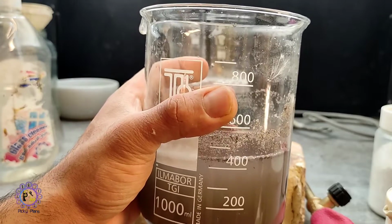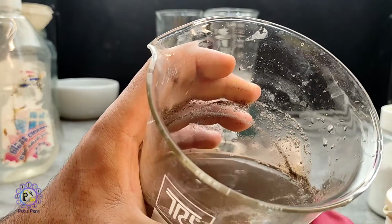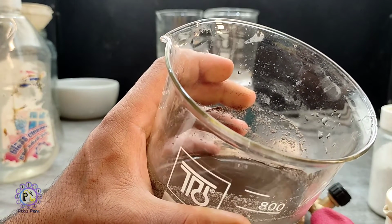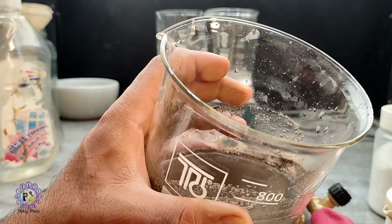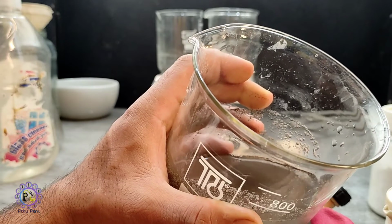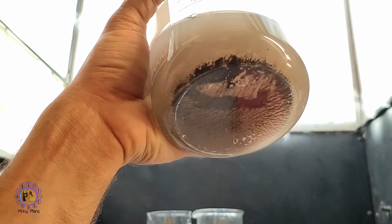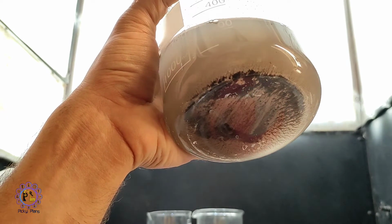This is the black residue that I collected from the nitrate solution and then separated using ammonia solution from the silver chloride, and I think it is tin metal hydroxide. I tried to reduce it to metallic form by reacting it in acidic condition with aluminum powder, but it seems to be unsuccessful. Actually, it isn't worth doing all this hard work to reduce and process this black residue, and I just did it for investigation, and I'm really happy with the information I got and hope you enjoy.